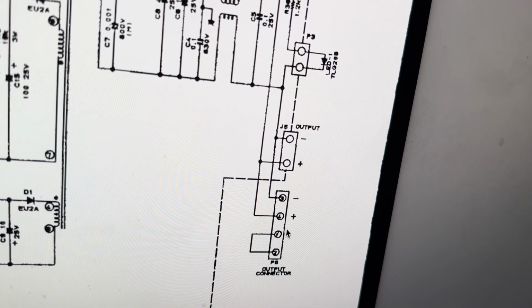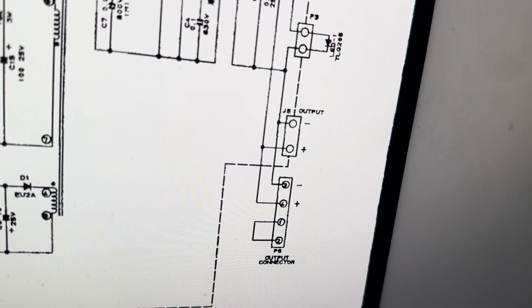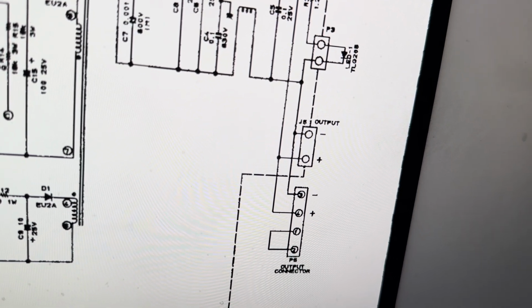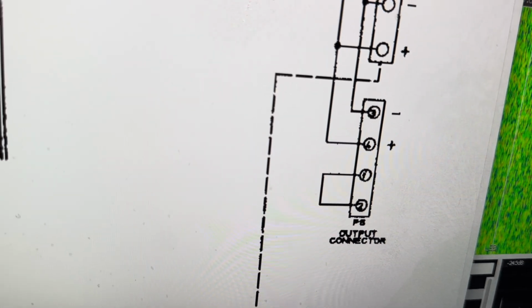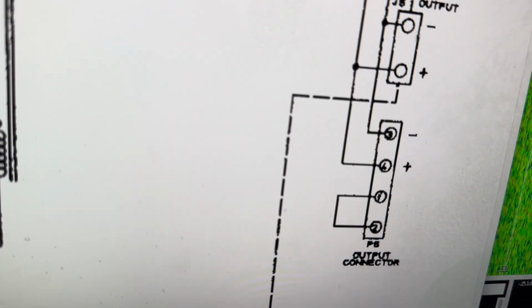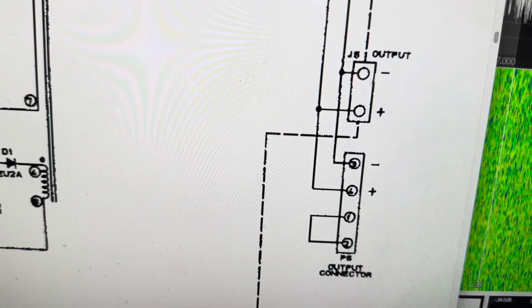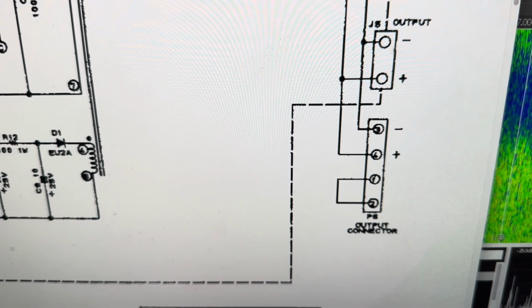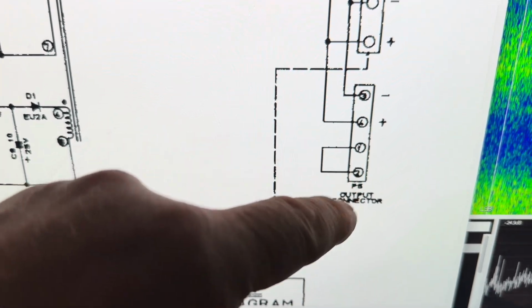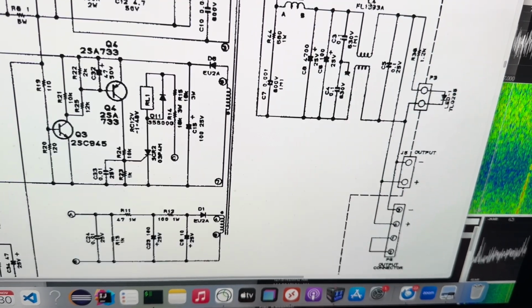And this stuff here, okay, so here they have pins 1 and 2. Let's see, what pins are those? AC jack, power switch. Okay, so it's 1, 2, 3, and 4. They simply have 1 and 2 connected together. And that's what I was doing initially, and that worked initially. So I had these two connected together, which would be these two, and the plus and minus, and it worked. So I'm not sure why now I have to apply power to these. Looks like they just jumped these together in the power supply. So that's a mystery of why I got to do that.